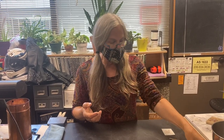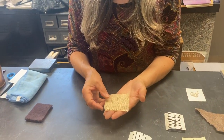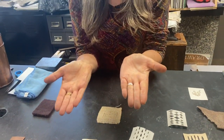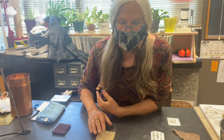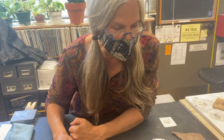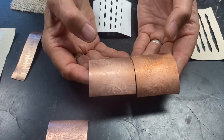One of the other really great processes with the rolling mill is to roll print and make pattern and texture. One interesting thing — and our first project will be earrings — is if you take a pattern like some burlap, laminate metal in between the two, anneal it, and roll it through the rolling mill, you have a matched pair. So they match, which is really great for earrings. I had a couple of matched ones around here — these here have been rolled through the rolling mill and they match exactly with each other.